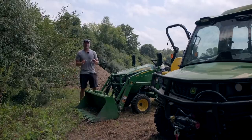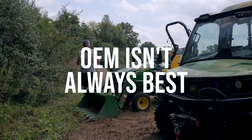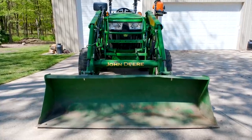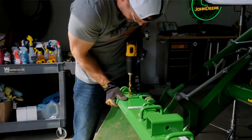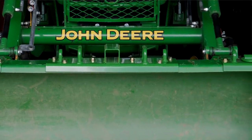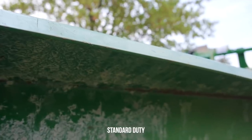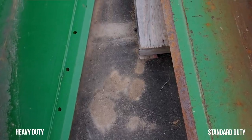Next one: your buckets. A lot of John Deere owners, myself included, see tractors come in with a bent top rail. In my opinion, this is about having a little too thin steel on the standard-duty bucket for John Deere loaders. That top rail gets destroyed and mangled — it's easy to bend. You can get a heavy-duty bucket that is way better. I have bucket brackets on mine from JU Fabworks — order from their website and save 5% with code GWT — and those help protect and reinforce the top edge and give more versatility. I think it's a cheapskate move by John Deere. Kubota doesn't really have that issue. Consider ordering the heavy-duty bucket, or if yours is too far gone, we sell HLA buckets that are comparable to the John Deere heavy duty.